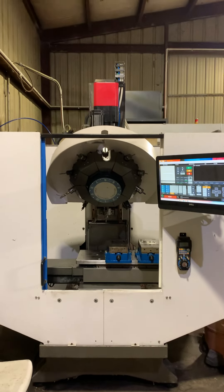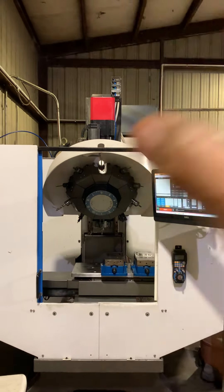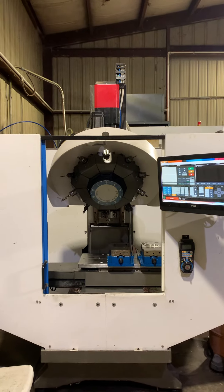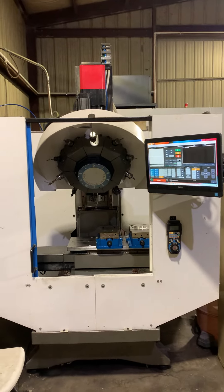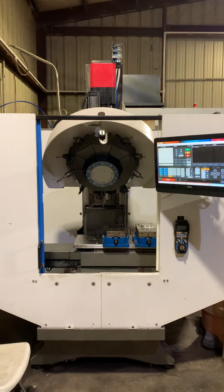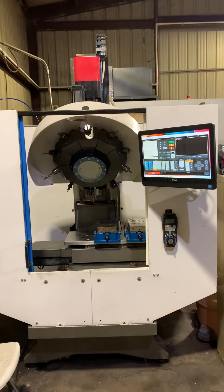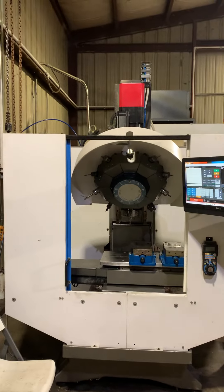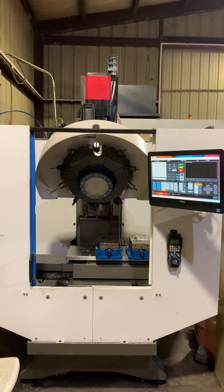When it was one-to-one, I could only go fast with no tools on the carousel. Once I started putting weight on the carousel, it would trigger the alarm on my servo — the stepper was not able to keep up with all that load. That's the reason I ordered this gearbox, and it's a good upgrade. Either get a bigger motor or make sure you get a gearbox for your stepper motor.